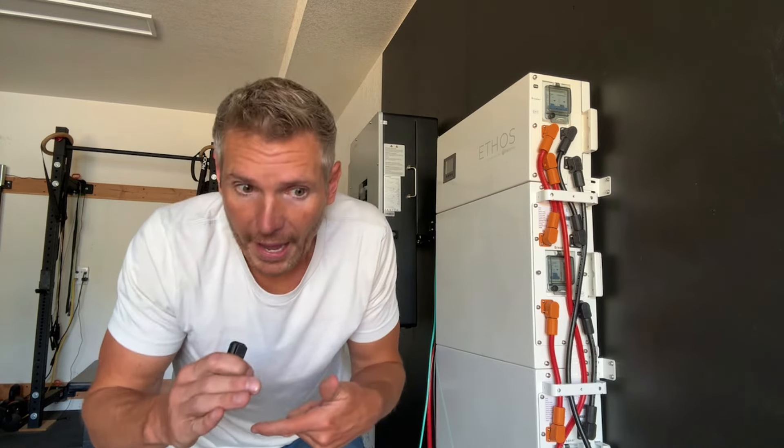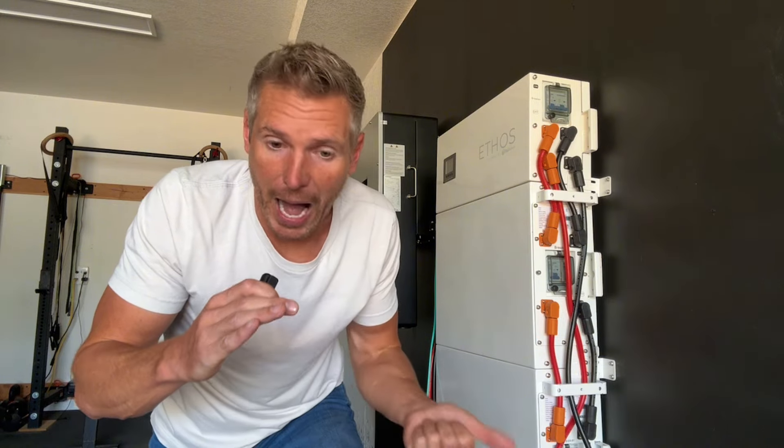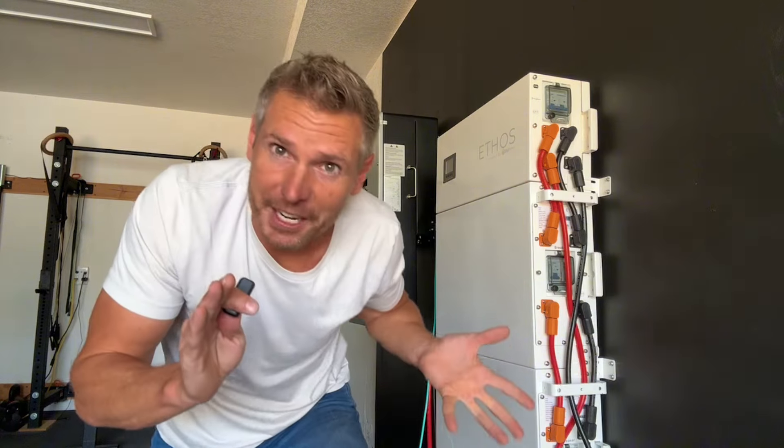These batteries are lithium iron phosphate. They're less prone to overheating, meaning they're safer — they reduce the risk of fires or explosions. They have a very long lifespan, and this one has a 4,000 to 8,000 charge cycles option, which is crazy. Over time, this means they're more cost-effective. They're high efficiency, meaning low self-discharge and great energy conversion. They perform really well in most all temperatures, have a high current rating, and they're not as heavy comparatively to other battery options. And these come with a 10-year warranty.